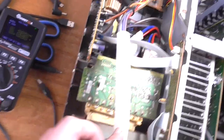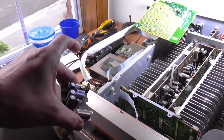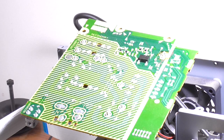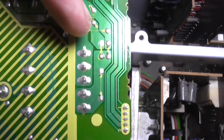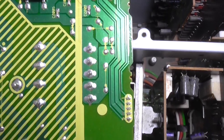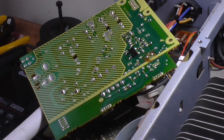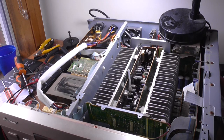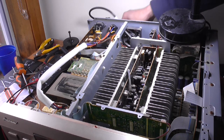I've taken the main metal brace off because I want to try and get this control PCB out. I pulled out this board which I think is the regulator board — I'm just going to touch up a few joints on this. As much of a pain as that was to get out, I have got the main standby switching power supply board out. I can see that around that joint there it doesn't look properly soldered. I'll touch these joints up. I had to re-solder practically every joint on the PCB, but nothing beats being thorough. Now I need to plug the board back in and screw it back down. I don't really want to pull the power supply module out because that involves taking the back panel off — millions of screws. This amplifier is a nightmare to work on.